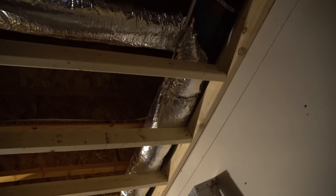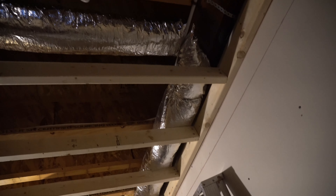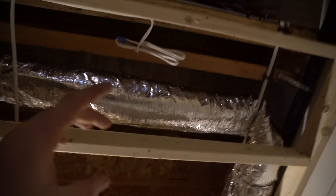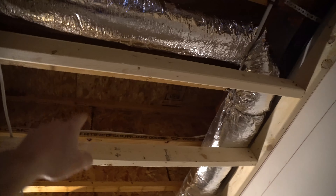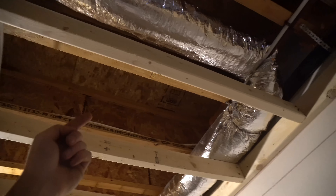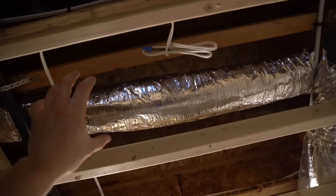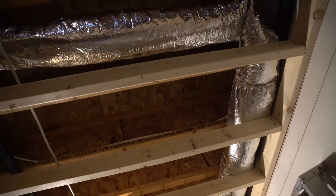It's also way easier if you have an attic to get into. If not, running that wire without a drop ceiling can be a little fun. I would suggest if you don't have a drop ceiling, going to the next stud cavity over and cutting in your fan. So your light's over here and your fan's right here. You can drill through from this side or just put it right beside the light that's in the bathroom. It's not the best aesthetically, but it's just how it goes.